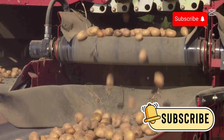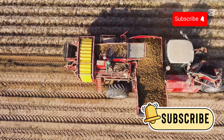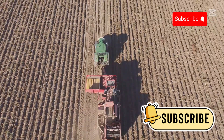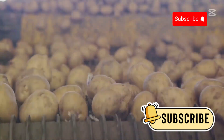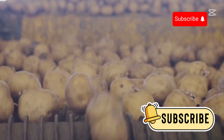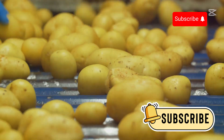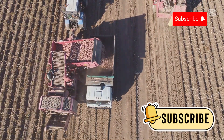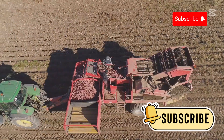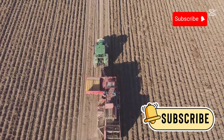The stems and pods after processing are discharged and can be used as organic fertilizer or fuel. On large farms, potato harvesters are also commonly used. The digging blades at the front of the machine penetrate the soil, turning over the entire soil layer containing the potatoes, separating them from the soil without damaging the tubers. After being dug up, the soil and potatoes are transferred to a conveyor system at the rear of the machine, where soil, rocks, weeds and potato roots fall through the gaps. Potatoes are then transferred to another conveyor belt and into an integrated container or directly into a container truck. The harvest rate reaches 97%, meaning almost all potatoes are collected, significantly improving productivity and work efficiency.